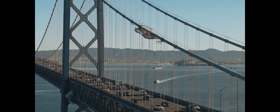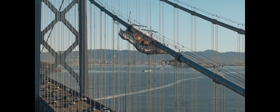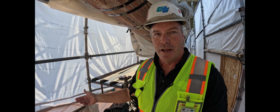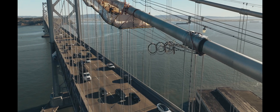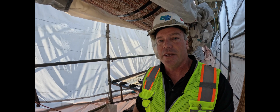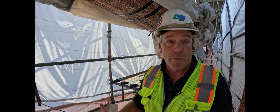We're only looking at 10 different locations for a few samples each so that we can get a good feel for what's going on with the steel. When the samples are cut out and sent away, they're going to a couple of different labs. One of the labs is in Los Angeles, but we're also working with Columbia University. The other thing that this project is doing is looking at the suspender ropes that come down off of this cable and hold the deck up. There are a couple of locations where we're going to be replacing those ropes with new ones.